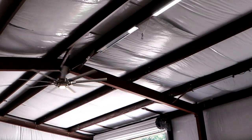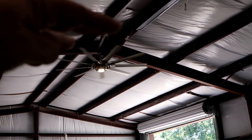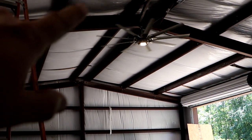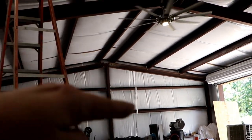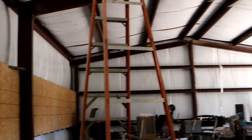Our building has a standard steel construction. I did install this fan up here — it's going to help pull the hot air down. This is an inexpensive fan; it's huge, it's six foot. In conjunction with the air conditioning system, it really helps to circulate the air. You don't want that hot air sitting up top — heat does rise — and you don't want the cool air at the bottom. You really want to mix this stuff around.